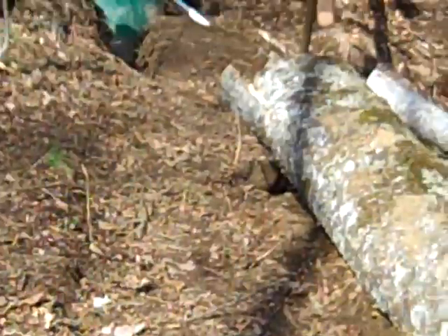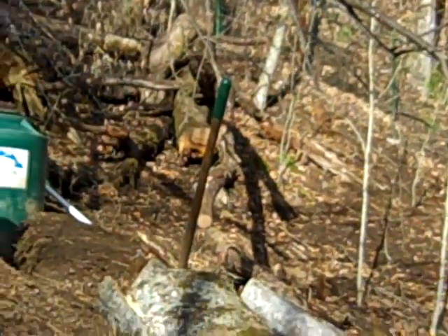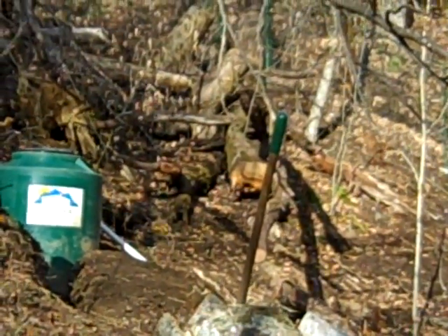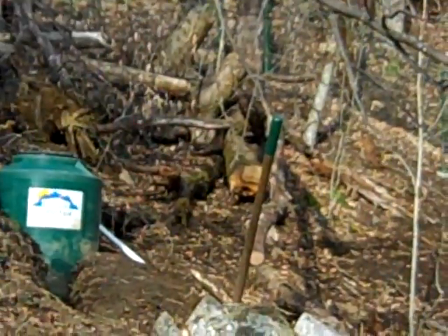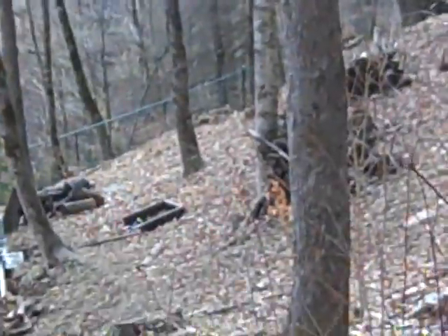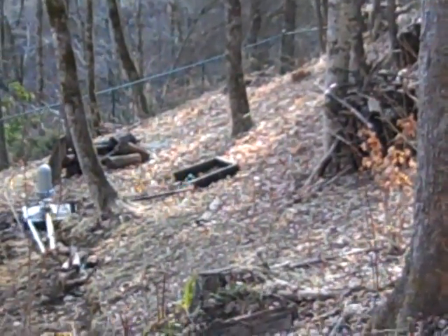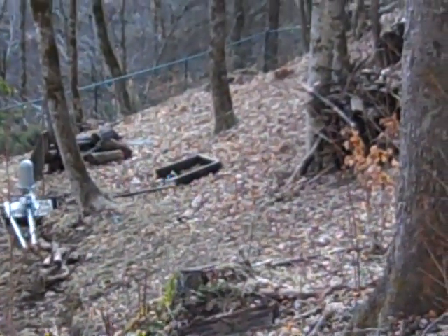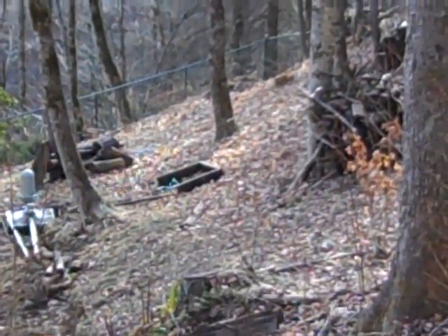I appreciate you watching my ram pump videos — this is probably my biggest challenge so far in terms of terrain, and it's doing exactly what it's supposed to do. If you want a non-electric solution and you have the fall and the water, it's just a great old-school way of delivering water. They'll have approximately 35 PSI of pressure at their fixtures. The spring was level with the house, so I'm pumping it up about 75 feet above the house to a tank. This Rife ram runs three to fifteen gallons a minute — I think I could tweak it to run on two.